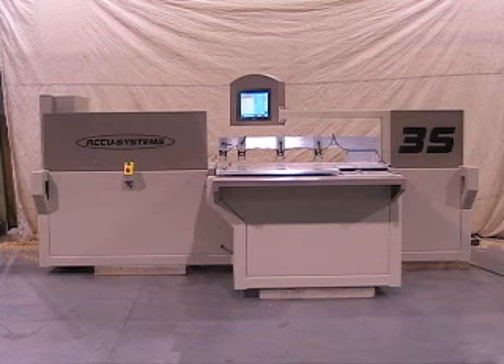The Y and Z axes have a 20mm rotary ball screw for precise positioning. Both spindles are 14 horsepower high-frequency HSK spindles for versatility. The tool changer is a servo-driven 12-position rotary carousel. The machining work surface is constructed of one-inch solid aluminum.